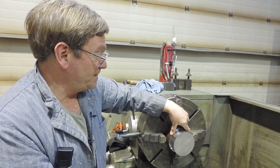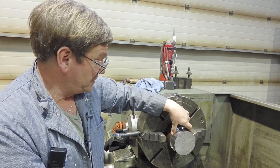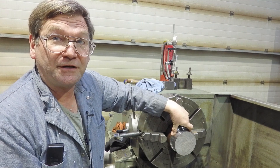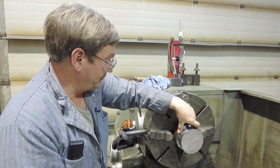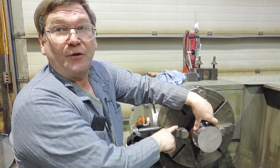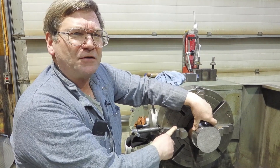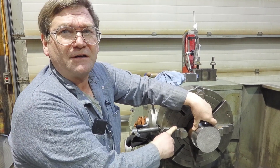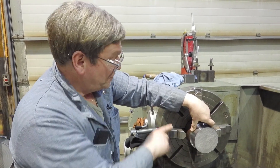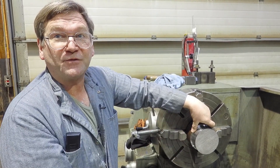If it's a good accurate six-jaw, they also make six-jaw and three-jaw scroll chucks, and scroll chucks for four jaws. There are also four-jaws that are scrolls. One I used to have and that was real popular in the late seventies and early eighties—they were in all kinds of shops—is a three-jaw or six-jaw chuck with adjustable jaws on top of it. Those were scroll chucks, and that was pretty handy.